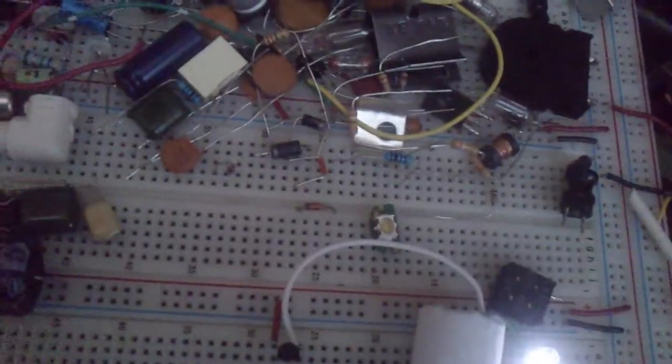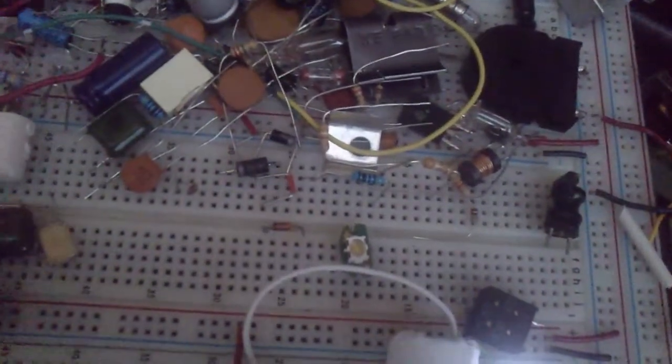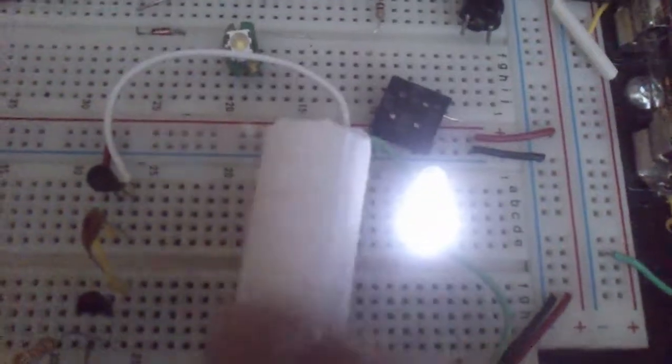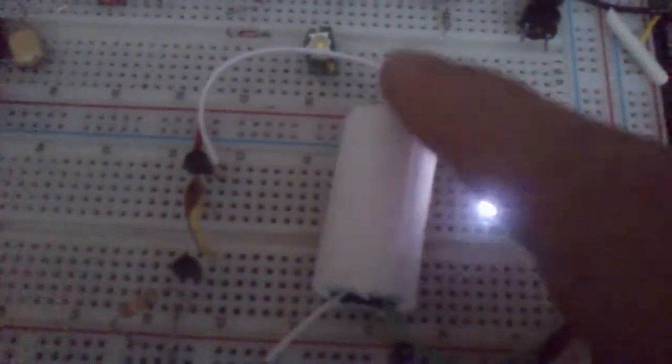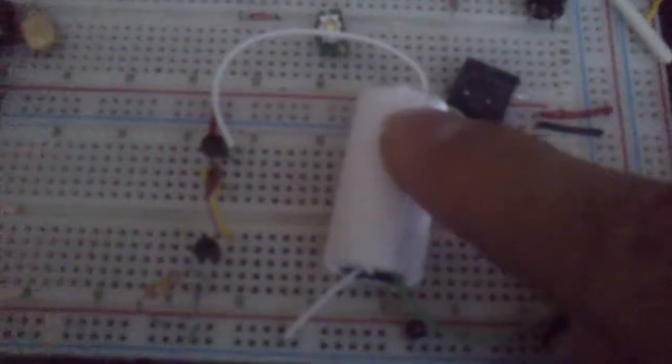What I've done here is I've taped together several similar ferrite cores — I think I have like five under there, no actually it's four, sorry about that. I got those from a power supply so they're all the same size. And I only have one loop of wire, so it's actually only kind of one turn, and the inductance of it is two microhenry.